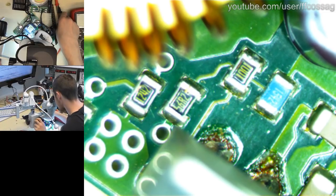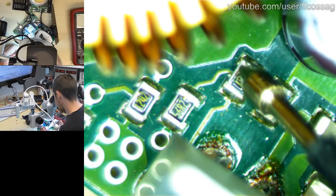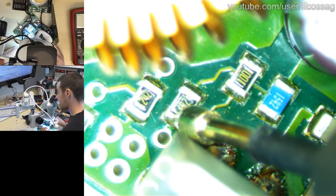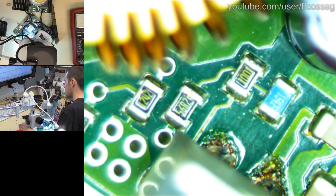Actually, I don't think a divider resistor is going straight to ground. Oh, it is through a 56 ohm resistor. Yes, so we have basically 1K. So to solve for R2, it's R1 times VO over Vref minus 1. But how do I calculate VO from... I hate maths. Okay, here's a formula. VO equals Vref times R1 plus R2 divided by R1.